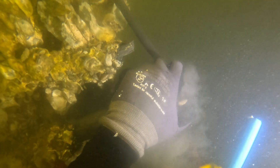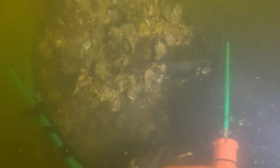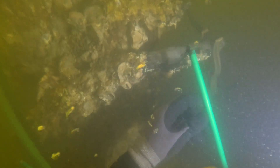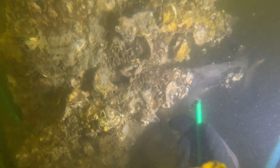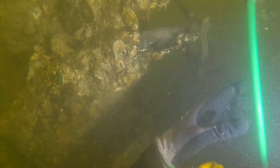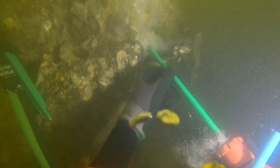Just about ready to start burning again. I have to peel back the tip of the torch to get good contact, and I'm going to push the rod in a little better so we don't get that oxygen leak this time. Pulling the trigger to make sure no oxygen is leaking out the base — and we're good to go. Now you can see these little champagne bubbles coming from the base of the torch where it meets the rod. Those little champagne bubbles are actually pure hydrogen bubbles, formed from the electricity splitting the water molecule back into hydrogen and oxygen. When you see those, that actually means your gear is wired correctly.